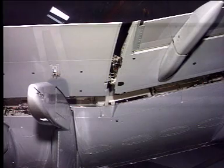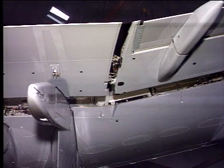It has these functions. It allows the inner and outer flaps to move independently within a specified limit. It gives a different load path for the flap drive system if there is an attachment failure, preventing inner and outer flap separation. It sends data to SFCC when the independent movement of the inner and outer flaps is more than a specified limit. It absorbs energy if a flap drive disconnect occurs.